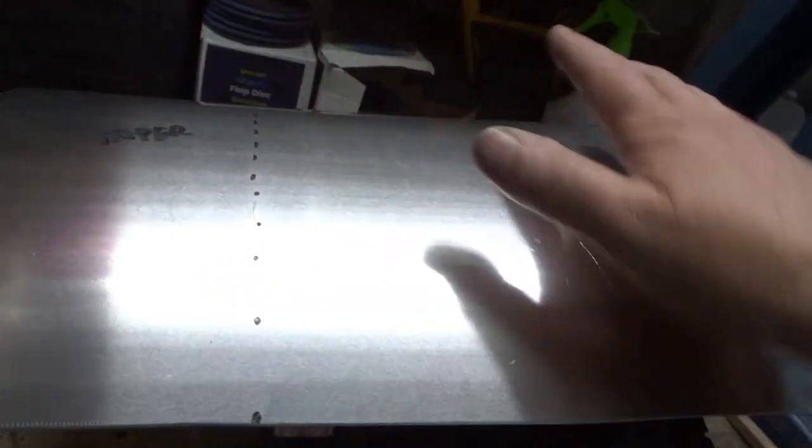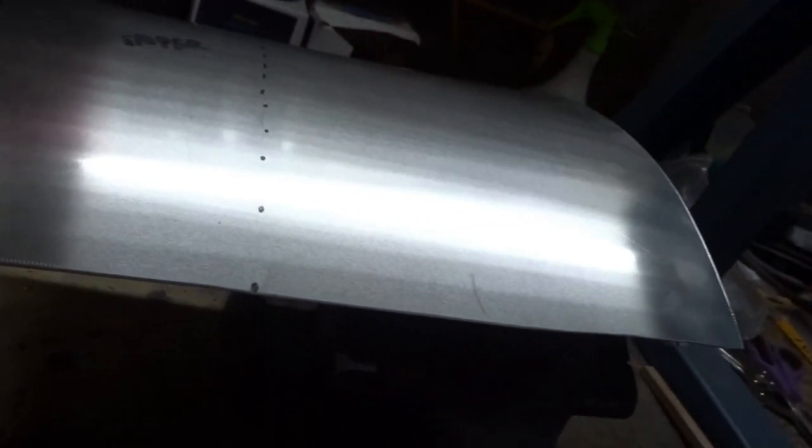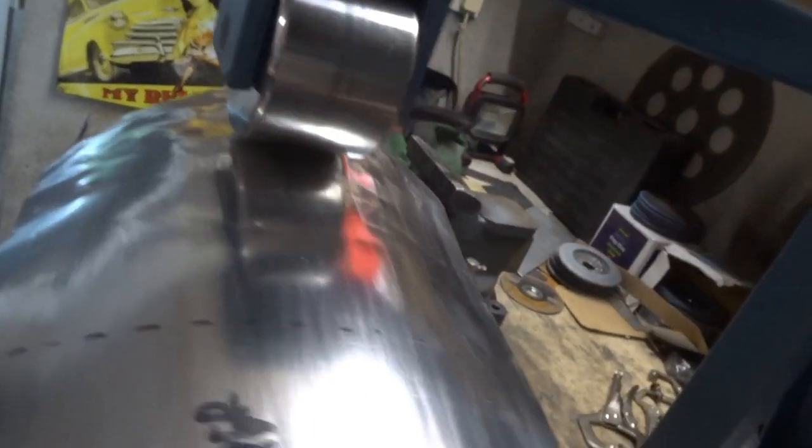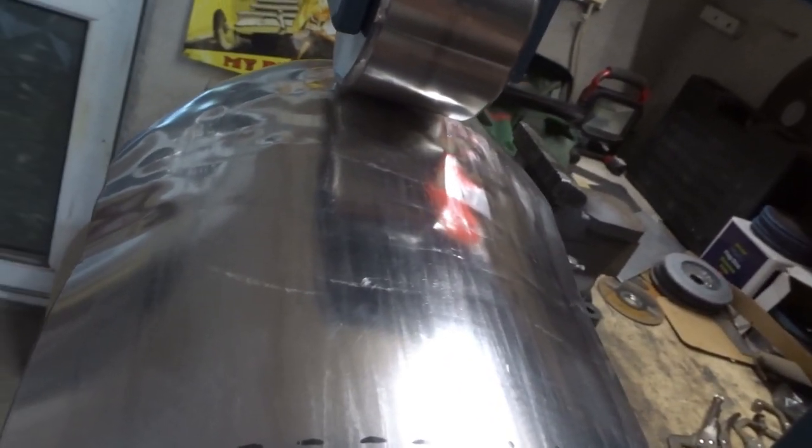So just put a bit of curve in with the rubber-coated wheel. Now I'll try and sort of get it to curve like that and see what it starts to look like. This is a bit of an experiment — I've basically bashed it a bit, particularly to get the end to come over like that. Now I'm wheeling the bumps out, with the wheel not really tight — not enough to stretch it, just to smooth down the bumps. It might work — I wanted the end to curve in, so that's what I've got. I'm just smoothing the bumps out; the wheel's not stretching the metal, if anything it's compressing it. I'll see if I can retain that curve on the end and repeat it to make it come in a bit more.